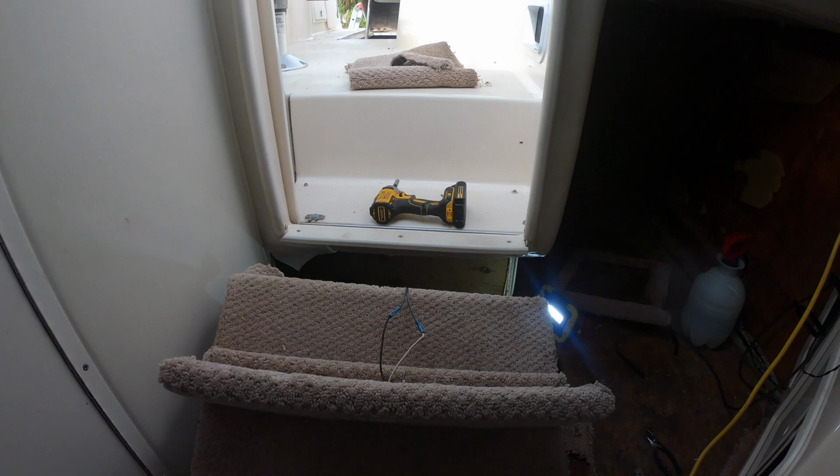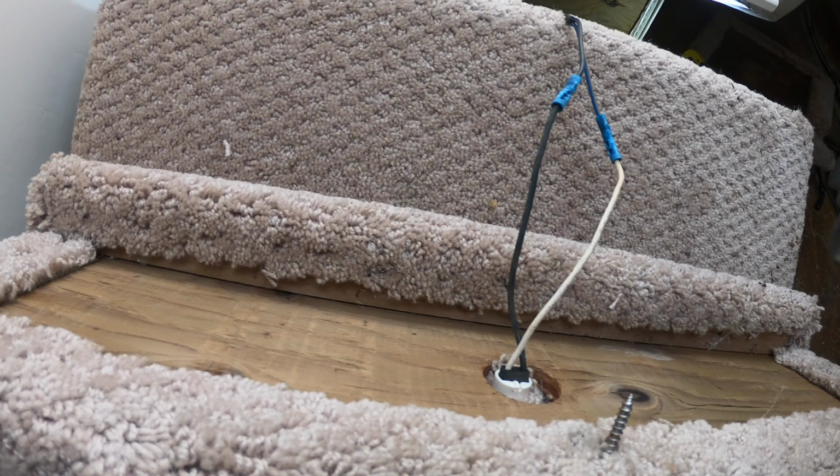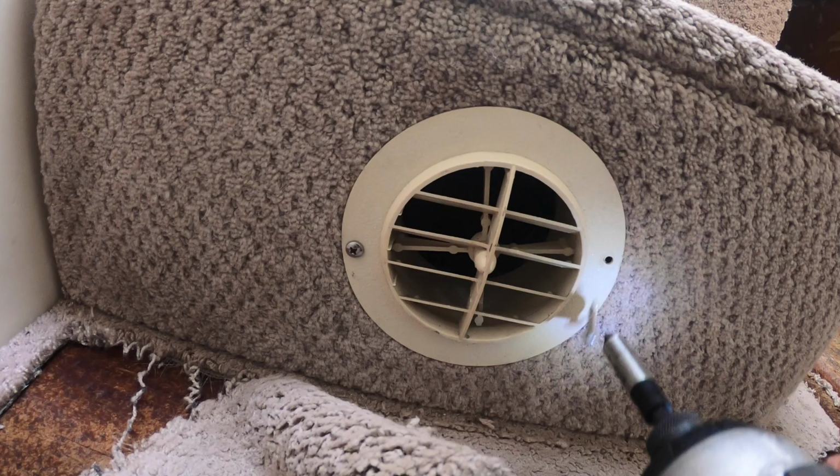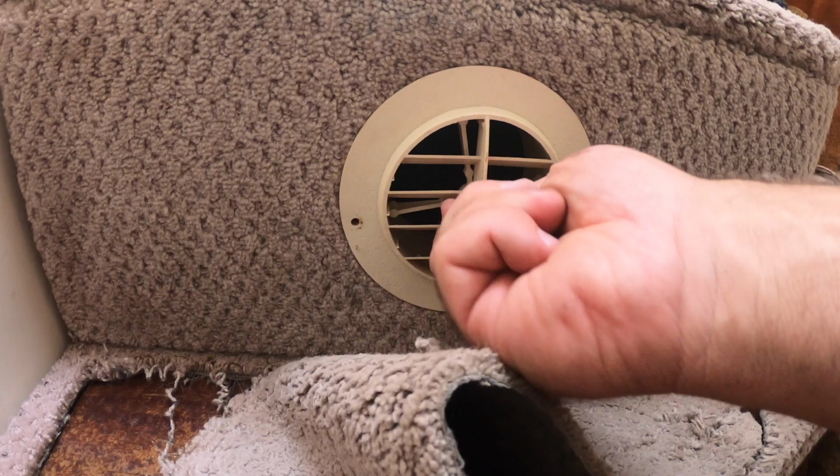We're going to have to remove the old steps, but they also have a light inside of them, which did not work, and the air conditioning duct. We guessed that there was mildew inside of the air conditioning, so we decided that we would replace all the ductwork and the air conditioner. We also upgraded from a 4-inch to a 6-inch duct to move more air.